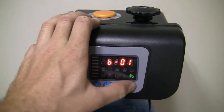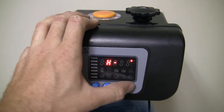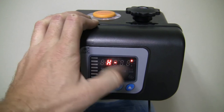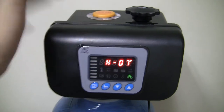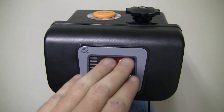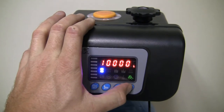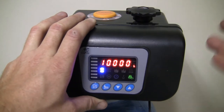I'm going to go down quickly to show you the days setting. Right now it's set to 30 days, but I want to set it to 7 days — you can hold the button down to go quicker through the numbers, and that applies to all the settings. So setting it to 7 days means that if I reach 7 days, it's going to go at 2 o'clock in the morning and do its regeneration. Or, if 10,000 liters go through the vessel before those 7 days, it's going to trigger the regeneration.